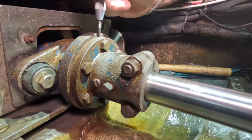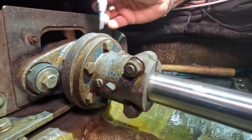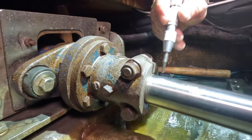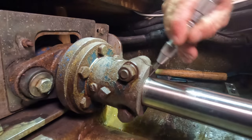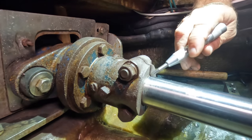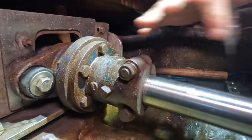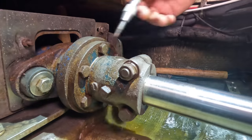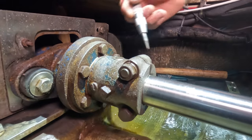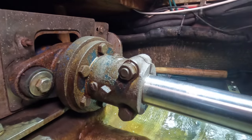I'm putting a couple of witness marks here using this punch — a couple of marks so when I go to reassemble this I know I've got my line up. I've also put another mark straight there so I can see where the keyway is on the shaft. It just means everything goes back exactly how it was. Probably don't need to do that, but if something's not right, I know this is the way it was installed and this is how I'll put it back together.